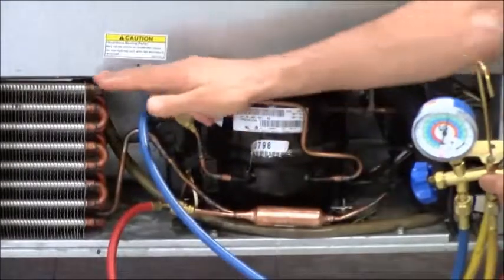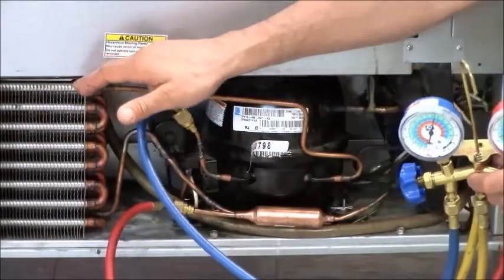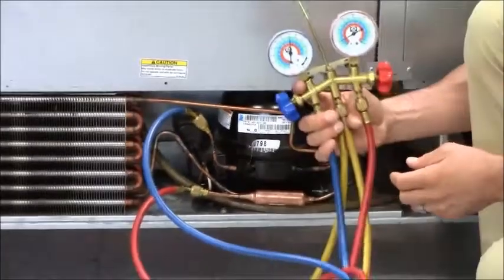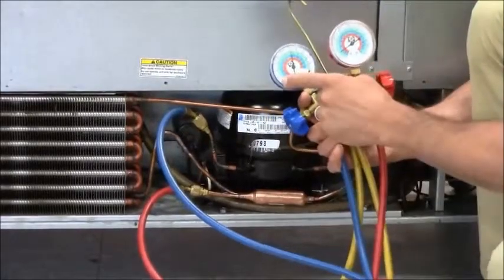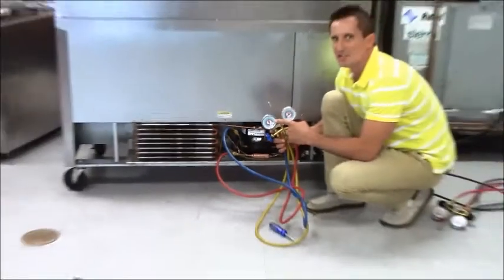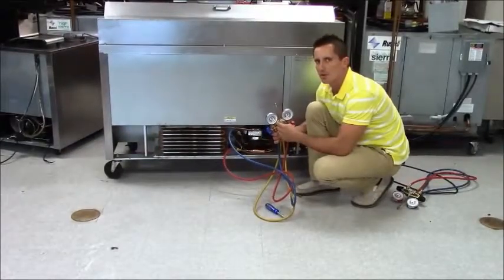All I would have to do is follow my piping and identify it by figuring out where the condenser is. If you have any questions or problems, please give me a call. Just before you grab a set of hoses and connect them to the refrigeration system, make sure they have an R134A PT chart — that will make it easier for diagnosing your problem instead of picking out a PT chart from your pocket.